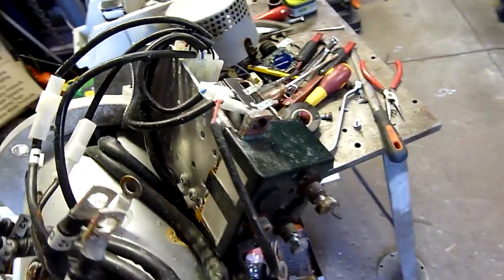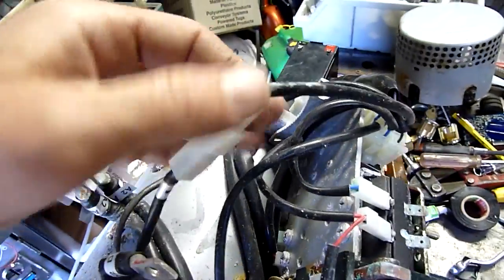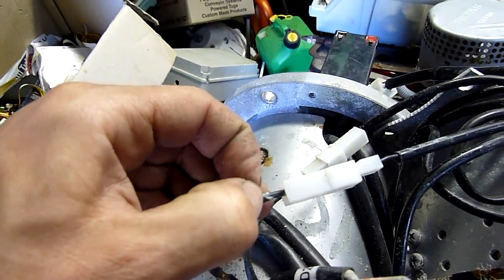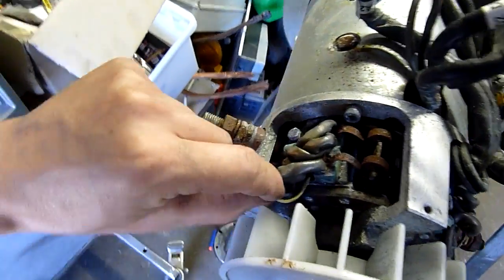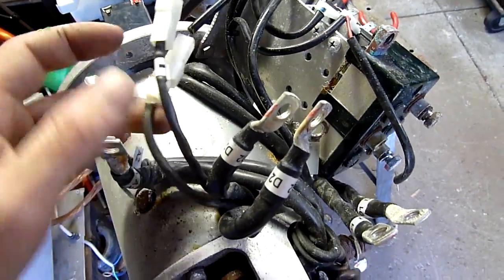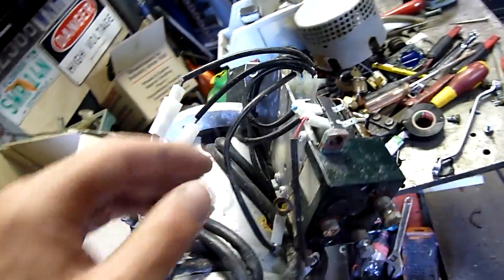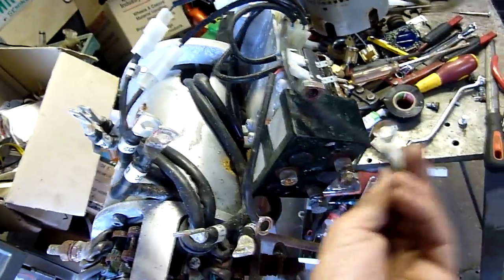That contact has definitely got some water through it — you'll have to strip that down. I hope it's salvageable because it'd be nice to have the original control gear for it. Black to black, and that one there is brown to yellow — yellow is going down in there, which might even be a thermal cutout. There has to be some kind of temperature monitoring on this thing. Anyway, I'll keep stripping it down. Now that I've logged where everything goes — positive, solenoid 1 and 2, and A2 up in there — if it doesn't help me, it'll help somebody else out.